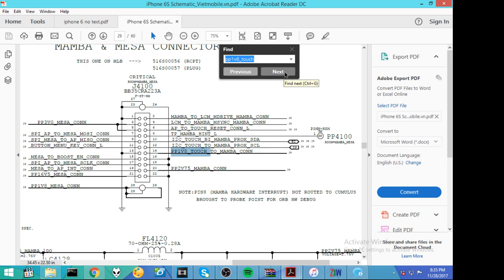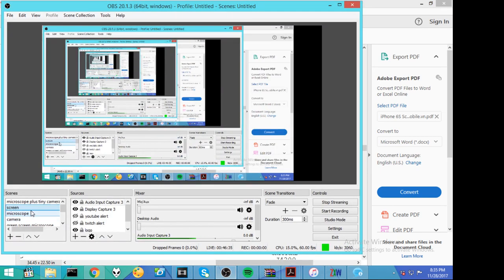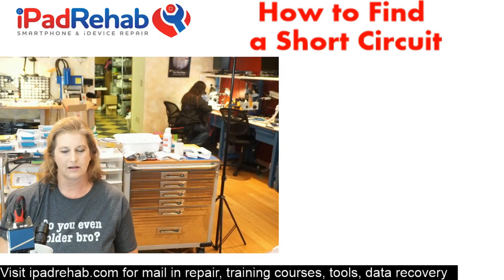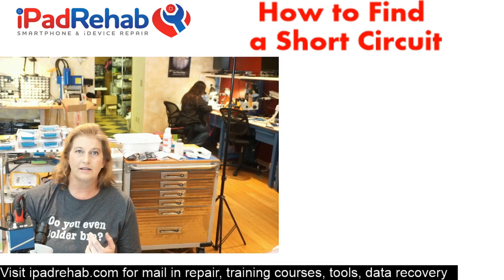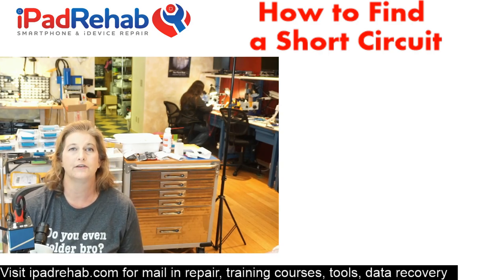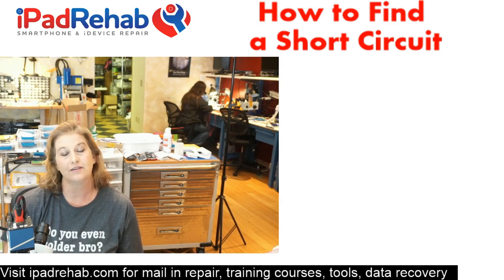Okay. So now what I want you guys to understand here. Let's get rid of this and go back to here. What I want you guys to recognize with this exercise is, one, that the thing that gets hot is not always the cause of the short. It's just helping you figure out what line is short. So first identify the line and then figure out the dude.